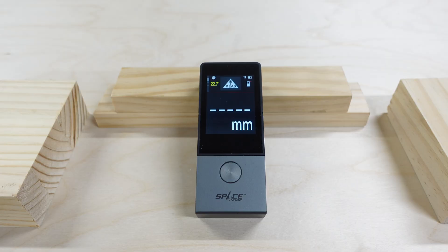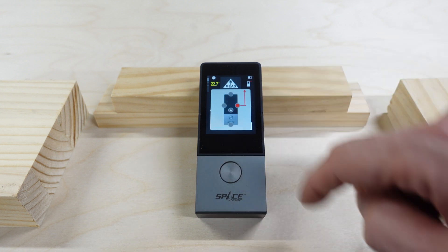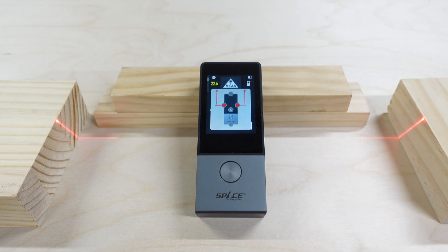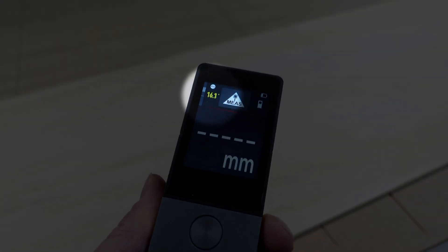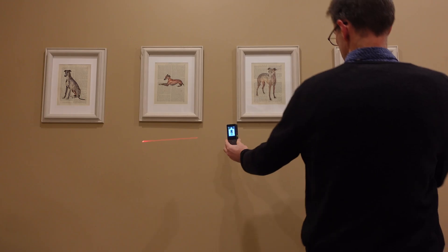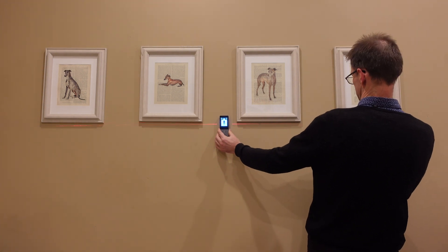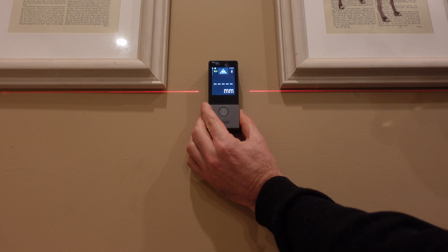But before we talk about more complex measurements, we should talk about the lasers. Tapping here allows you to select where you're measuring from. On the D9 Pro you can measure from the front or the back, and for more complex measurements like point to point, you can also select the tripod setting. The lateral lasers are a very cool feature — you can turn on one or both. The lateral laser works really well with the digital level. This small number here is the digital level and it's constantly updating depending on how you're holding the device. You can view this in bubble view or in 360 degree mode. Let's say you wanted to align some pictures hanging on a wall — you can easily align the lasers to one side or both to create a horizontal reference line. In this example, if I align the laser horizontally, you can see that two of the pictures are hanging correctly but the other two are out, and I can then use that reference to fix that problem.